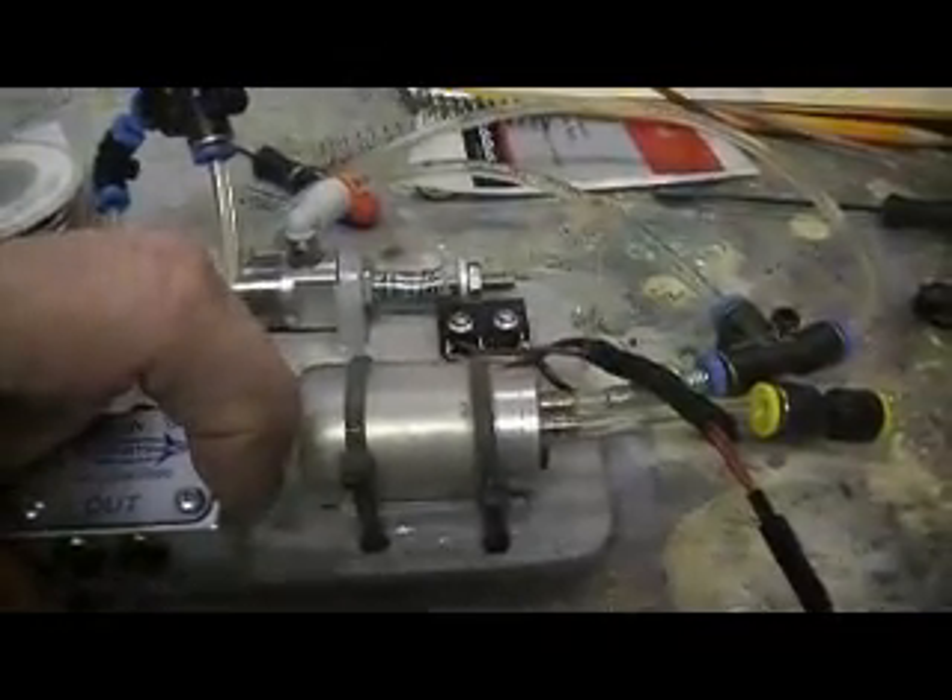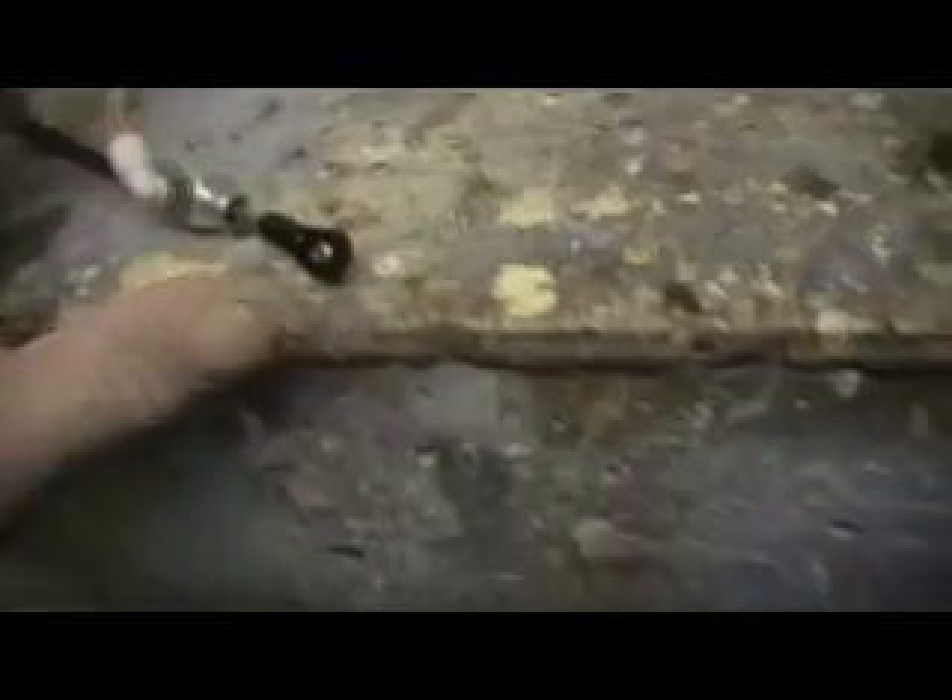It's always drawing fresh oil, but my problem is I got some air bubbles in here. As soon as I get those air bubbles figured out, it's going to work great. See, the servo moves — bam, it's moving — it actually starts to move before the pump even kicks on because the spring is forcing it. I'll flip the switch — ready, go. Because the spring is actually pumping it. I think I'm going to need to put a little bit tighter spring on it.